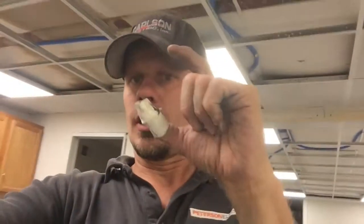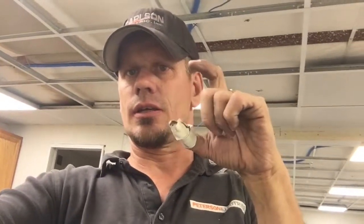We made our loops fairly large so our fixtures can drop down. These LED fixtures by Long Light — they're on Amazon for 45 bucks — about 30 percent of them didn't come with the little fixture wire that was soldered, which is like 20 gauge. My wife said half of them didn't, so we had to stab 12 gauge in there. Next time I'll use two, three, or four port stab connectors and extend with my own 14 gauge solid pigtails, because when I used 12 gauge and had to pull something out to redo it, two of them broke.